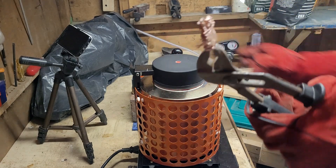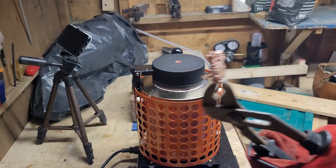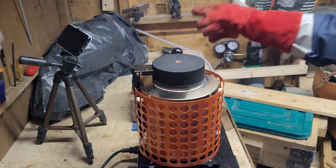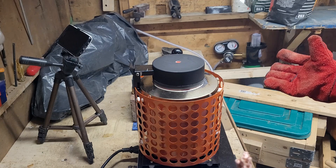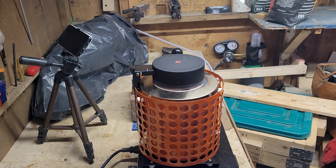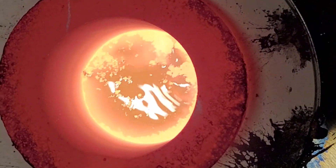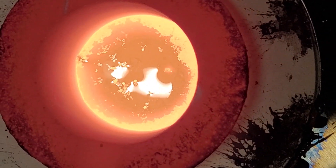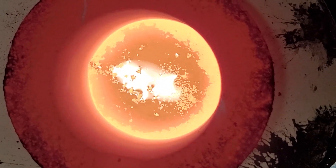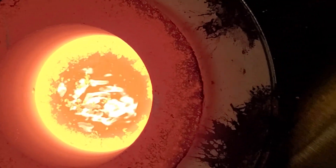This is the last piece I'm going to add right now, and after that has been totally melted I will pour at least one ingot, because my ingot shapes are cooling off too and I'm afraid those will get a little bit of moisture again. One steam explosion a day is enough. Last bit before the pour has been added — you can see it's still not totally liquid. We'll wait five minutes and then pour the first ingot. We're pretty much there, give it a minute or two and then we're going to pour.